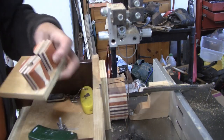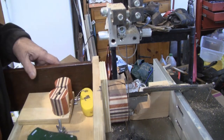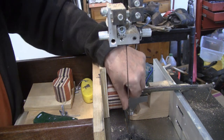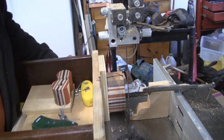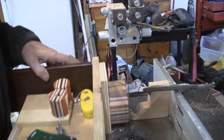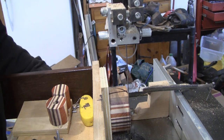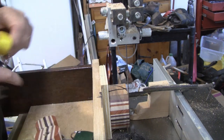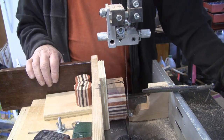I have the two smaller ones on one piece of plywood, and the biggest one is on a piece of plywood screwed to my bandsaw sled — the one I made for making thin slices for dizzy turnings. Right here is a ball bearing on my stop. It's adjustable by moving the fence, but once I get it to the thickness I want, I leave it there and slide the next piece up against it until it barely touches that bearing, so the thicknesses will be very consistent. It's a slow process — you've got to go pretty slow. Let's go ahead and cut one.